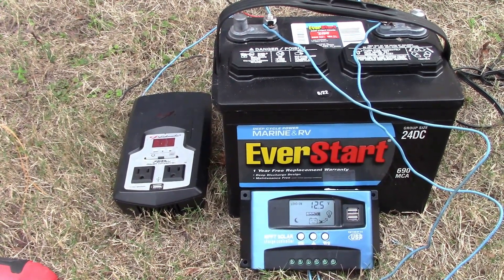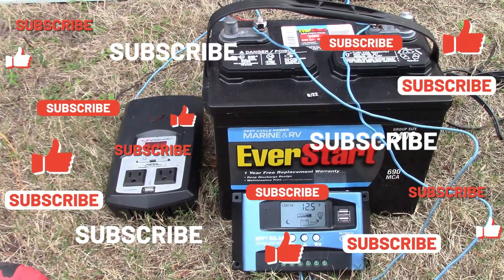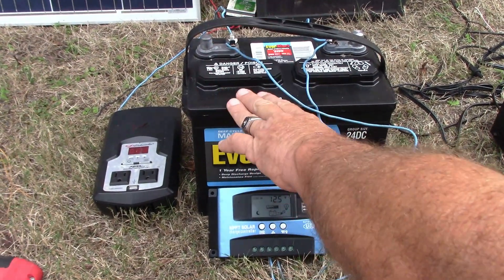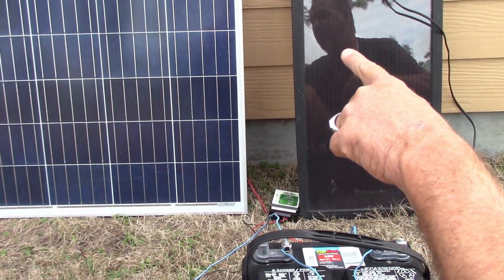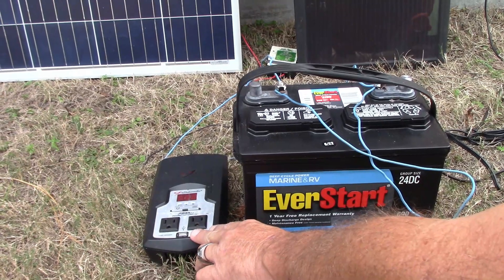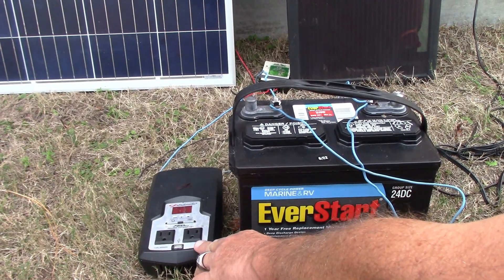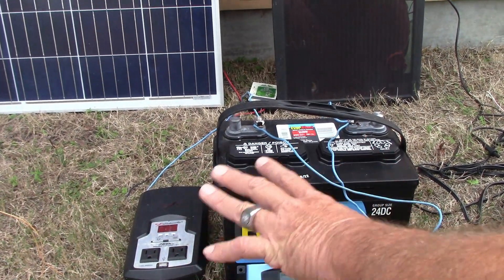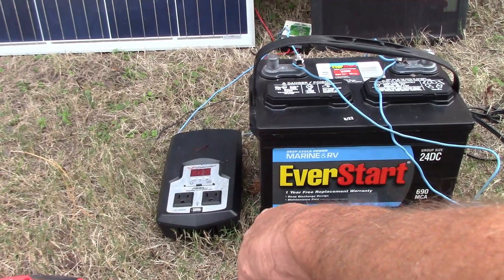I'm just trying to show you guys the basics today of how solar works — it's very simple. I have five batteries and eight panels, and that's going to be my setup. I'm actually waiting for my split-phase 240V inverter to come in. Right now if I were to lose power today, I'm perfectly fine — I can run my lights and my TV. This will not run my AC, but this setup is enough that I could run my refrigerator. However, since this is a modified sine wave, I would not run my refrigerator on it because I could damage the compressor and the motor.